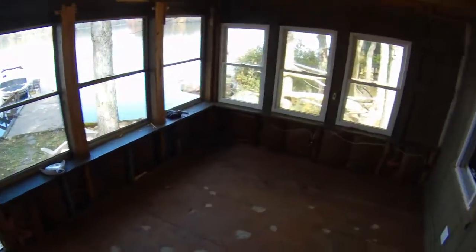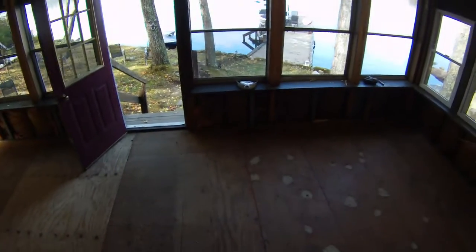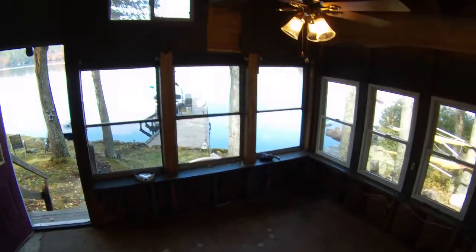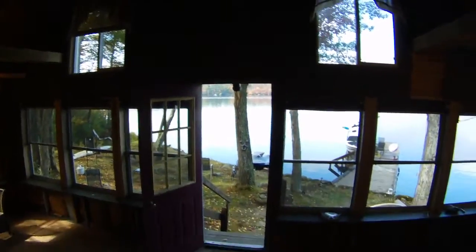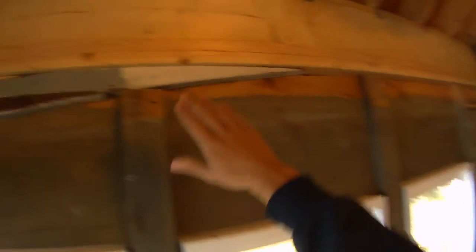What we have here is a porch deck. It was originally just a screen deck and they enclosed it here at a later date. What I've done so far is taken the fascia board off just so we can see what we're working with underneath. You can see they put a double 2x10 up here, which is correct, but they did not put any post down in the corner.